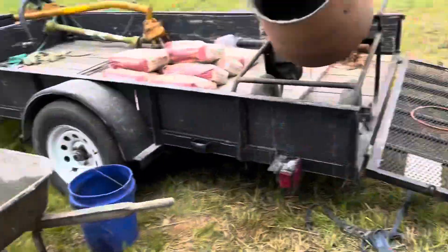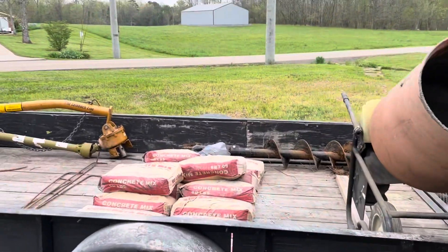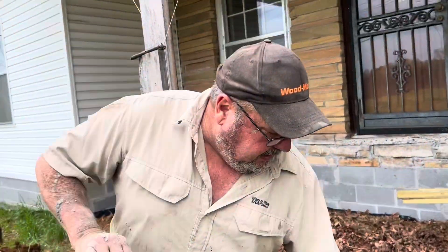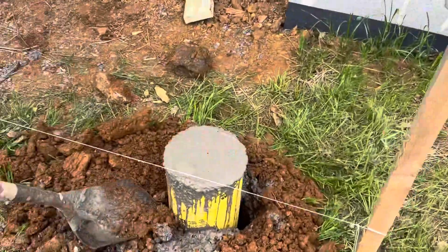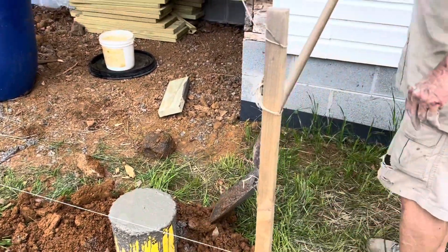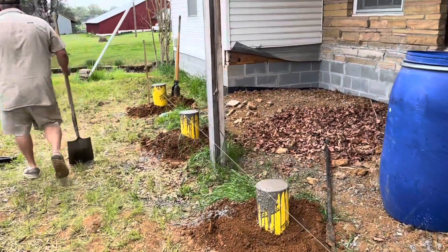He's going to finish up that hole and he still has two more to do. We'll bring you back when it's finished. We still got a trailer full of cement, so we still got a good little bit to go. Each hole took pretty much four 60-pound bags of concrete. When you're digging these holes with the auger, they're just a little bit bigger than the tube, so you're filling in the sides a little. We've got the mixer going, trying to get some of the concrete out of the mixer, because you've got to take it back clean.